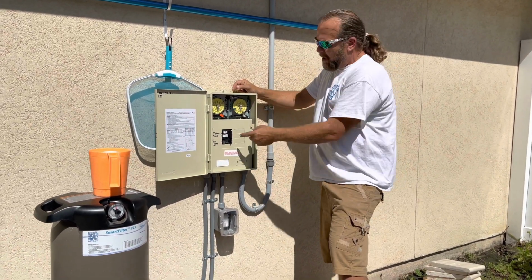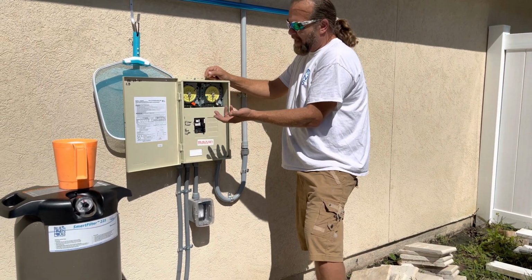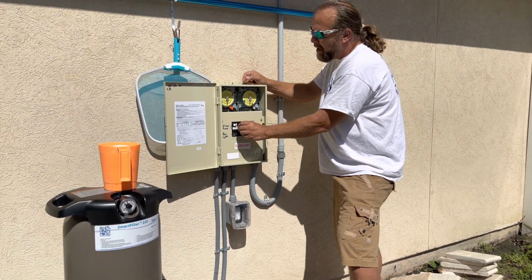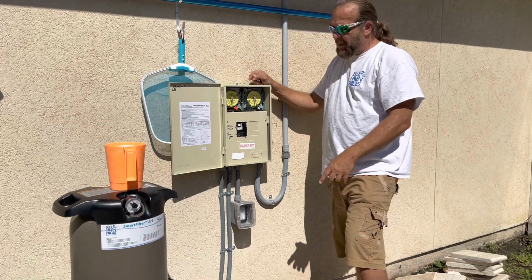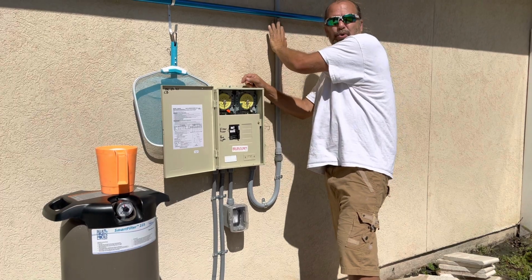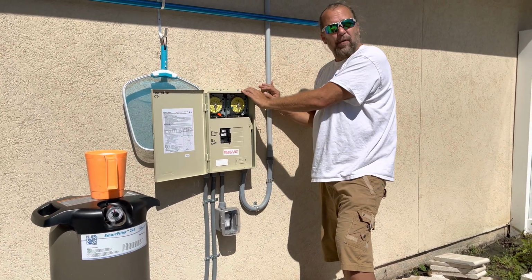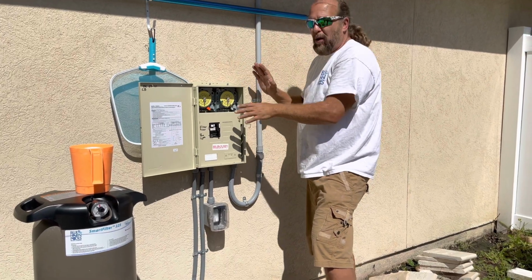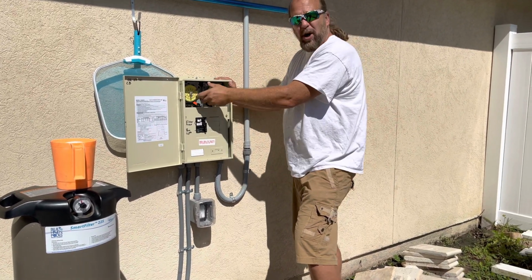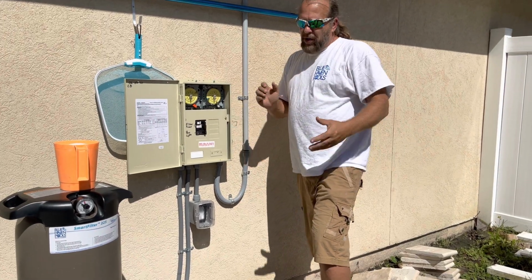Awesome. You got breakers. Do you have a GFCI protected breaker? So in case it's 3 in the afternoon, your pump should be on, and you don't hear it running, do come over here and check that first, okay? Because it is very sensitive. It's outside. This will trip before your house will trip. Now this is hardwired. This will trip and this could still have power, okay? When your house loses power, then know this lost power, you have to come out here and reset your time, okay?